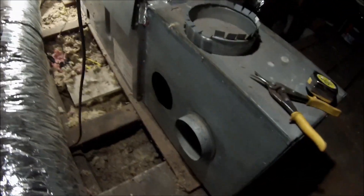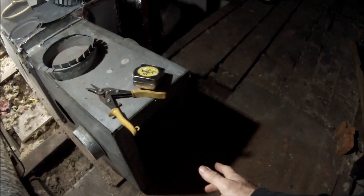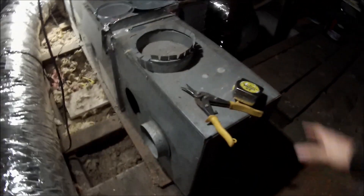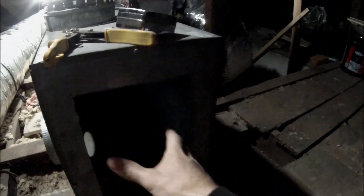I have another box I made for the very back to give air to the last two bedrooms. All the takeoffs were six-inch, so I'm going to eight-inch. There were two 6-inch on each side and one at the end cap — you're not supposed to put them at the end cap because all the air will come out there more than the others. So I'm redoing this whole plenum box, and you can see I already cut out this 16 by 8 for the new box that I built.